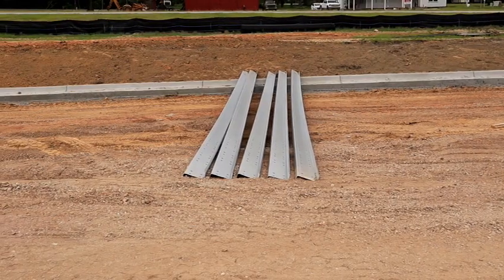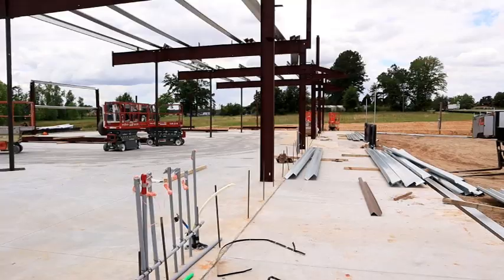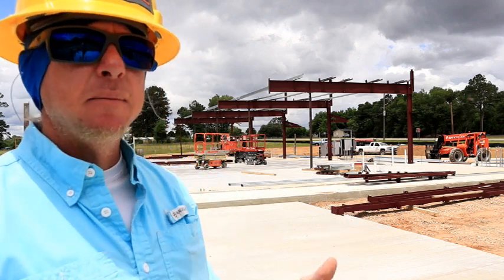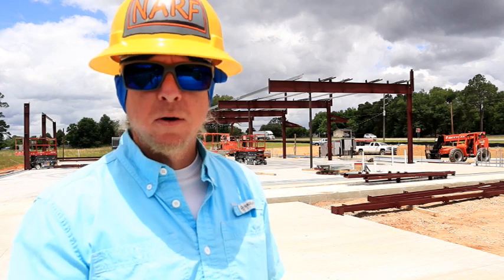All of my purlins I lay in the yard. On this particular build we've got five bays. The two end bays are the only purlins that are the same — they're marked P1. Bay two is P2, on the other end it's P5, and in the middle is P3. Then we have some extra marked purlins because we have some curbs on the roof and they're a thicker gauge.